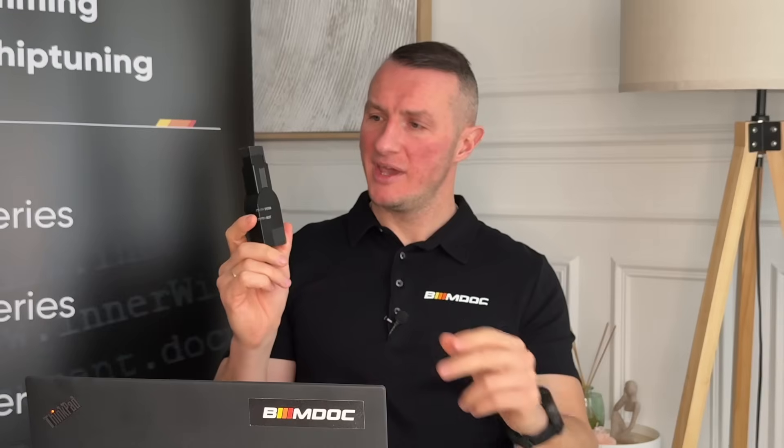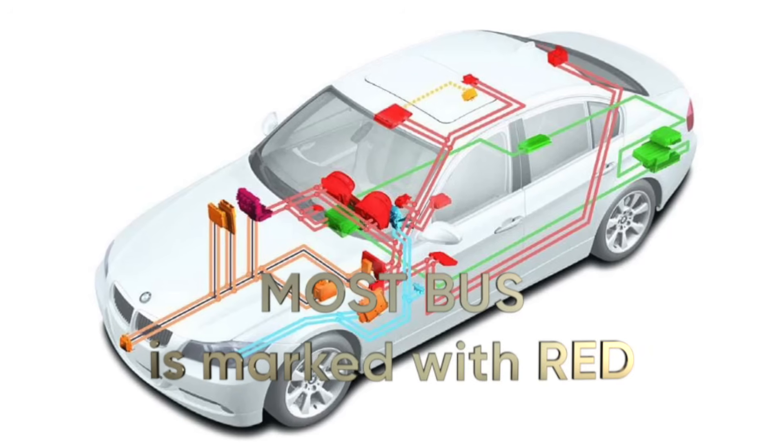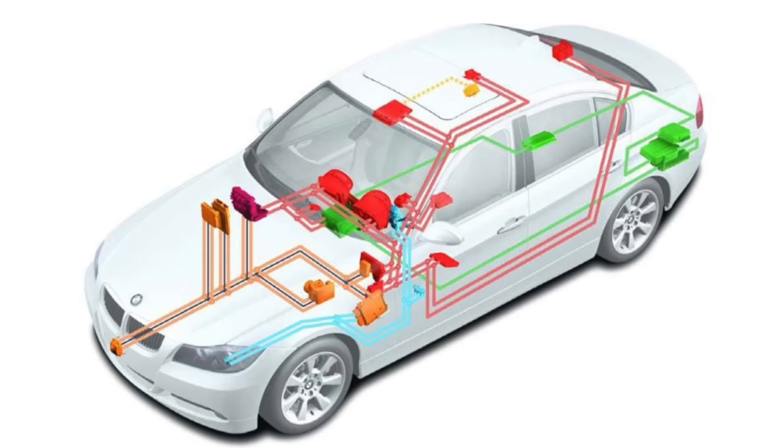That adapter is a must for E-series. It's not required on F or G series anymore because ethernet bus was introduced there, and all internal communication inside the car is done through ethernet. But on the E-series, MOST fiber optics is used between multimedia devices because it allows great bandwidth for sending information to different multimedia parts of the BMW. That special adapter is required to program it. This is the story of one of my subscribers — he purchased a Chinese clone ICOM-B.